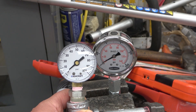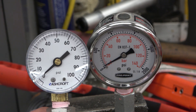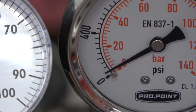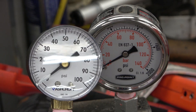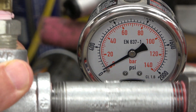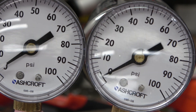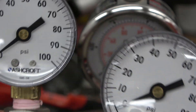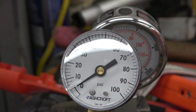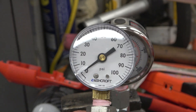Didn't blow, but it sure sucks. Not even close. Aye-yi! Something bit me. Yeah, we've got to put some different gauges in there — this guy with the batteries just barely came off the peg. That's what it should look like — you see it's in the middle of the range. Any kind of gauge that relies on spring tension, Hook's law being what it is, is not directly proportional at the lower 20% of the scale generally.